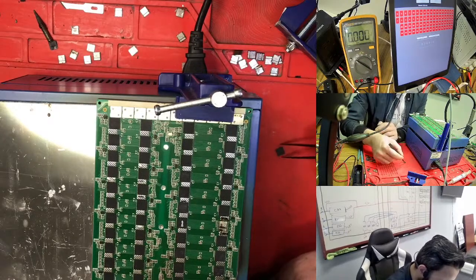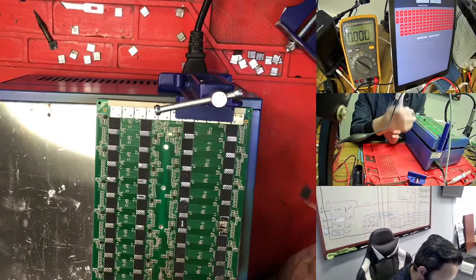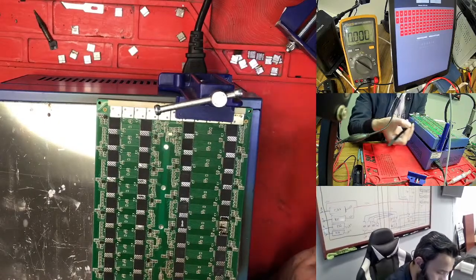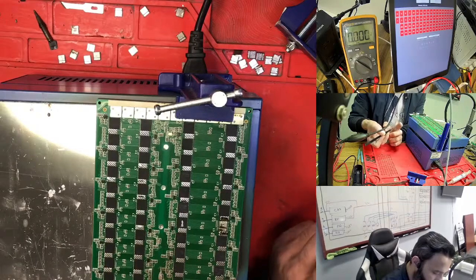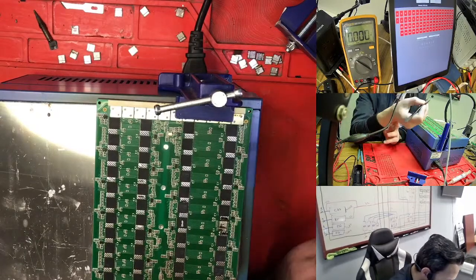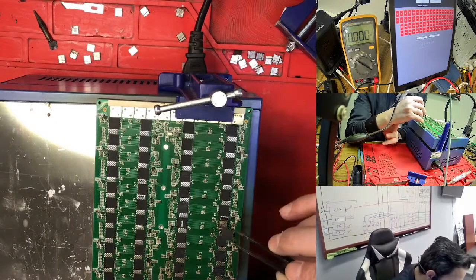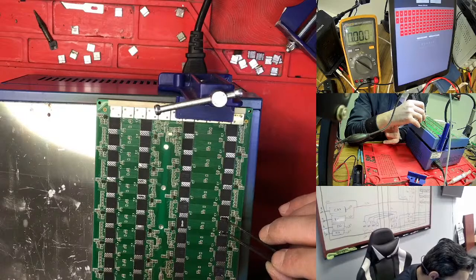But one more thing, about the side of the chip, don't forget: you have two parts, so you need to put the chip in the right place, because you don't have a dot on top of the chip to see how to place it. At the bottom you have the mark: one side is a line and a square, and the other is an L shape. Before you add the chip, check the top of the chip like this. If you put it in reverse, maybe it breaks many things, the LDO, a resistor, and then it is very hard to fix the hashboard.